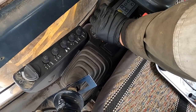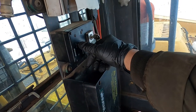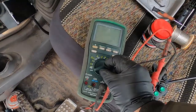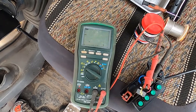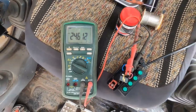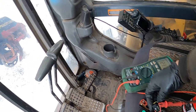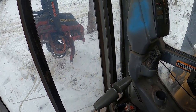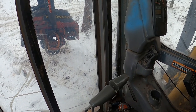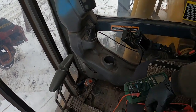The wire wasn't broken — it was loose and caused an intermittent issue. As you can see, we also have 24.6 volts supplied to the switch, so we have power. Let's push the button and we should see the function. Here we go — open, close — electricity can flow and make a closed loop.